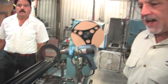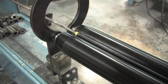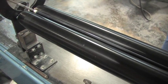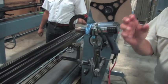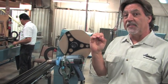This is an important step — this is where we bind the material onto the mandrel with cellophane. Basically it's scotch tape without the adhesive. What this does is hold the shape of the rod, because we're going to now put it in the oven.